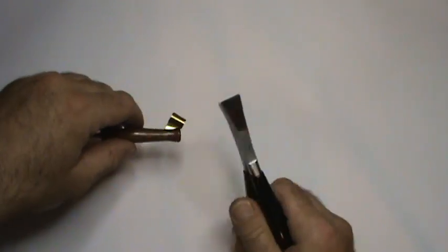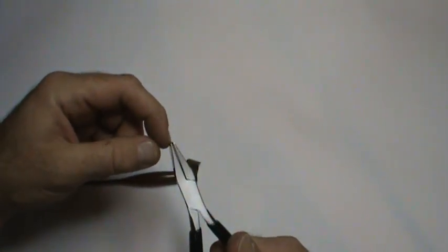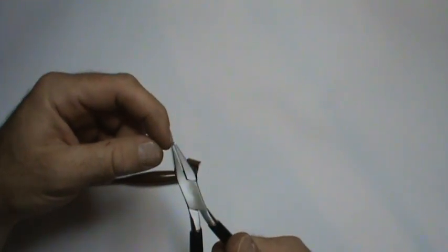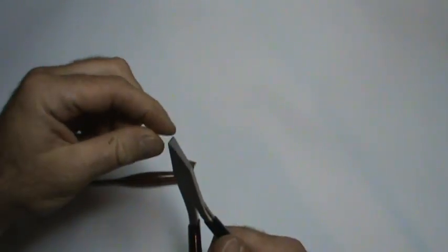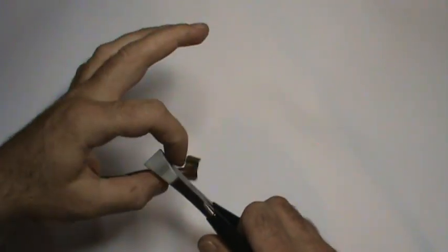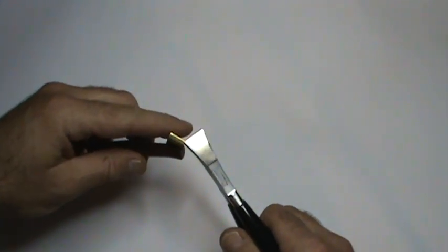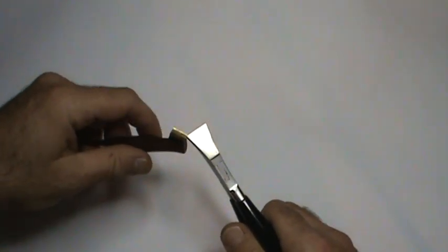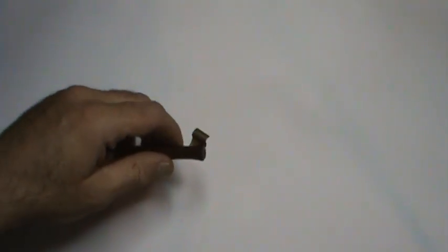The other thing I had made was the same thing, and these are called a Duckbill Plier, but again I had them create a small gap in here. That allows, when you're making your own flanges, which I'll demonstrate as well after I show how to adjust, it allows you to not crease them and crimp them so very tight. And I also wanted a swelled duckbill so that there were corners for those of you that prefer to grab and pinch the corners of your flange when you're adjusting the flange to fit a new nib, and we'll show you that here in a second.